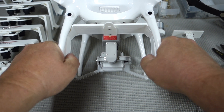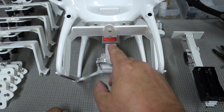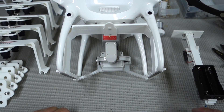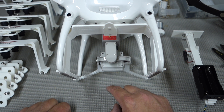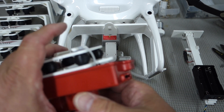You want to have this back so those are pretty much touching it. If you get it too far forward, it can interfere with the gimbal. The beauty of this system is you can use the gimbal and the Red Edge at the same time. So if you're running DroneDeploy, which we like to use for our mapping application, it works beautifully. You can do a full map sequence with the color camera in very high resolution and also be mapping in multi-spectral at the same time.